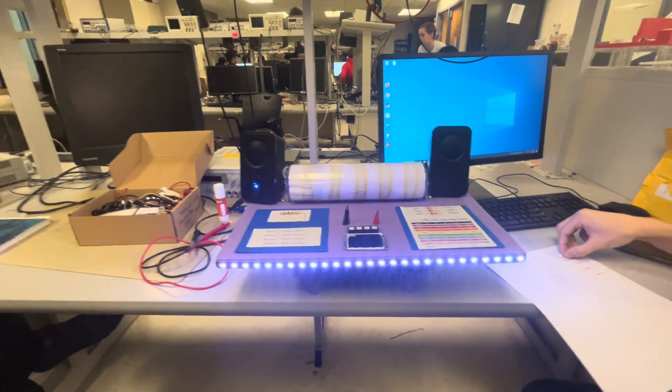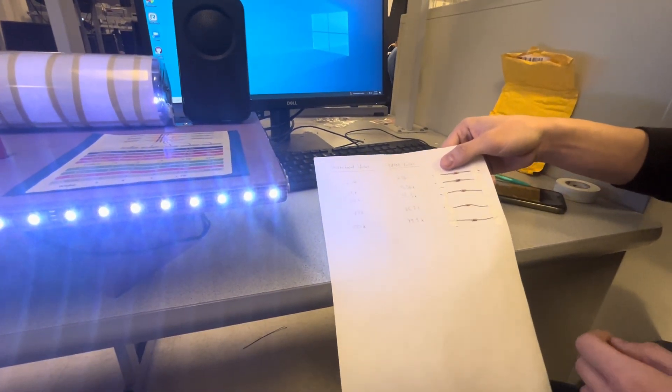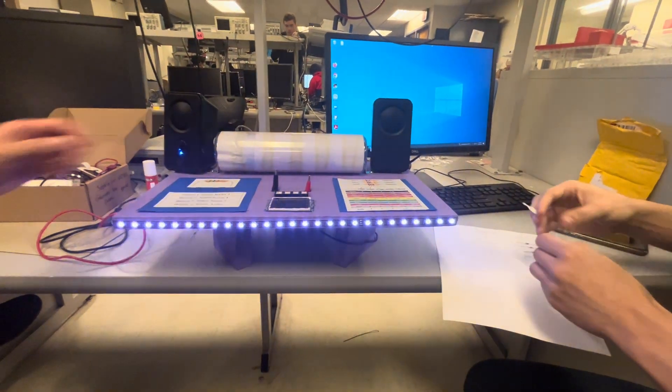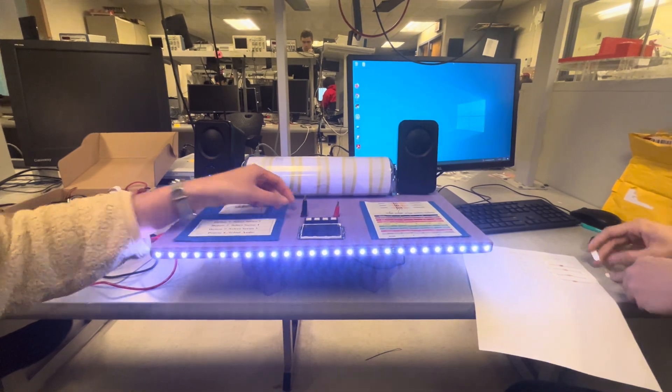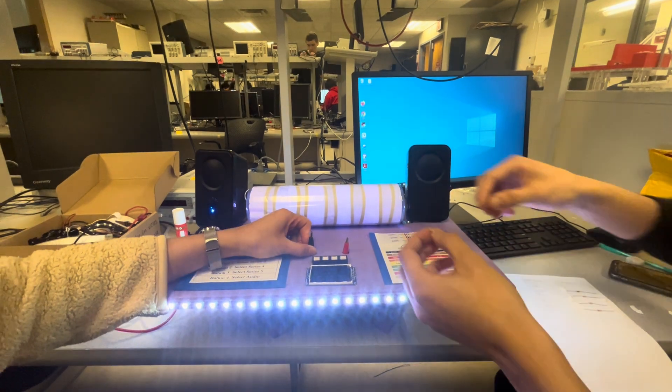So what do you want to start with? We have prepared a bunch of them. Let's do that top one — that's a 4.3K. So by multimeter this should measure 4.26K, and by color band it's a 4.3.